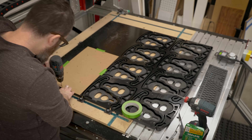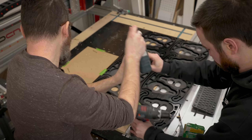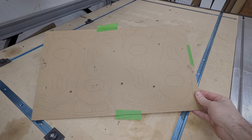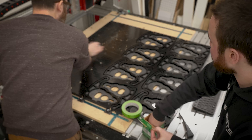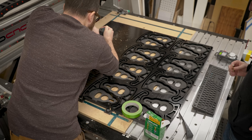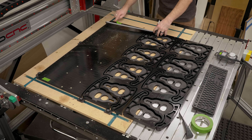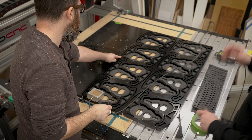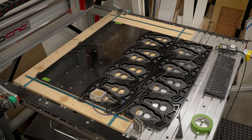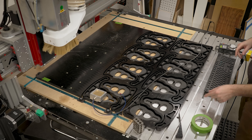Here's a better look at that cardboard template — it just has a faint outline of the actual parts laser cut in it and then hole locations for the screws. We tape it on to the location we're going to be cutting, drill through the template and the UHMW into the spoil board, and then add the screws. You can see this whole thing is flipped 180 degrees — we got two full rows cut and flipped it because I have aluminum T-track at the bottom of my bed and didn't want to cut through that. So we flipped it to cut through the spoil board and leave a nice strip of usable UHMW at the top.